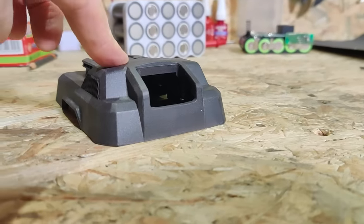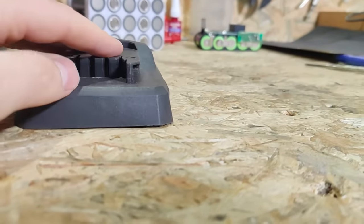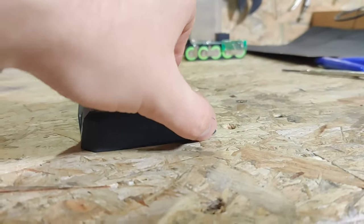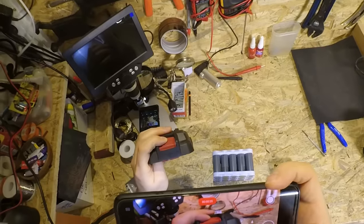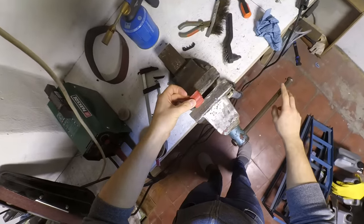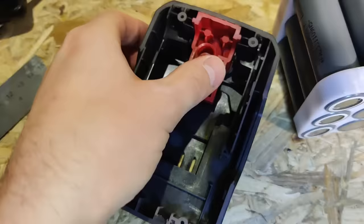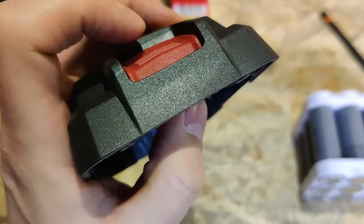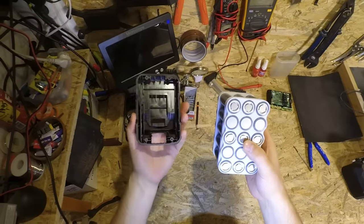This is more or less what you want to achieve — it's completely flat on the table. I did however make a little mistake on the back with the angle grinder, but I'm sure it will be fine. The next thing we deal with is the button: put it back, push it down as far as it goes, then draw a little line on the part that sticks out and back to the angle grinder. With the edge removed, it doesn't stick out past the plastic anymore, and the mechanism still works fine. That, at least for me, was the easy part.